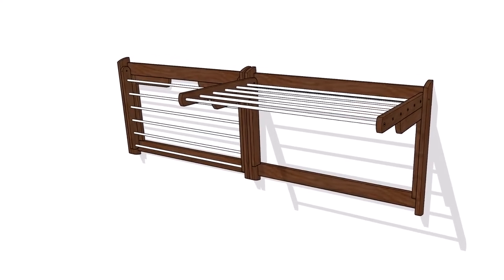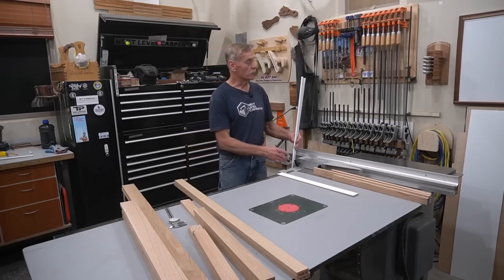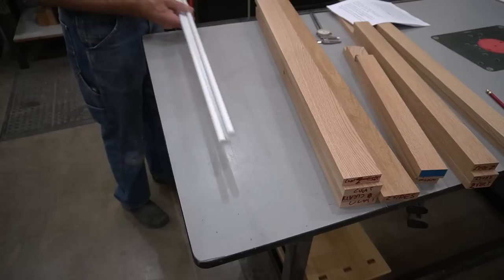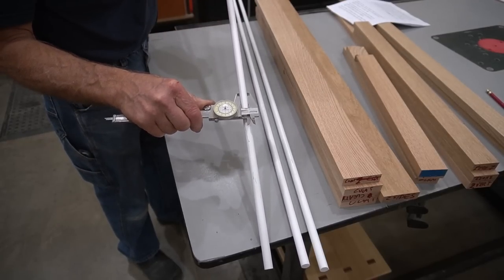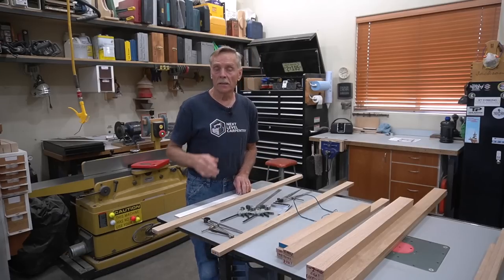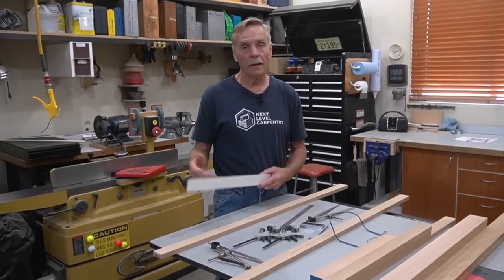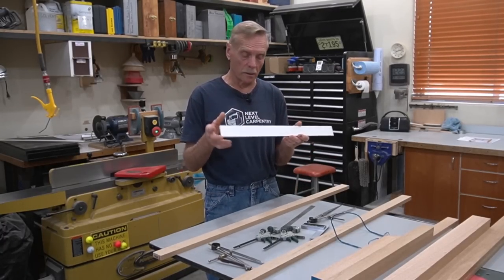Because the overall width of these drying racks is based on the length and diameter of the hanging rods and the arms that hold them, I start by laying out those arms. I found half-inch diameter fiberglass rods, five feet long, used for electric fencing, to be perfect for the hanging rods. These fiberglass rods are perfect because they're smooth, strong, waterproof, inexpensive, and have a very consistent half-inch diameter. With all stock preparation complete, I can finally start the actual build by making the arms that hold the rods. Because I've got to make four arms and I have a reputation as the template king to protect, I'm going to make a template to locate the holes and the curves on the ends.